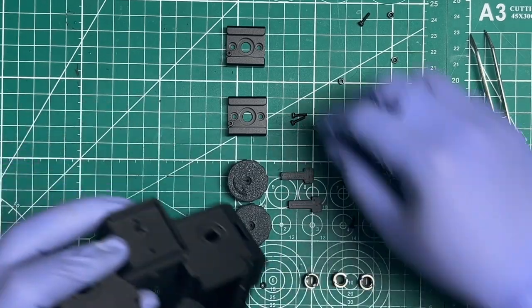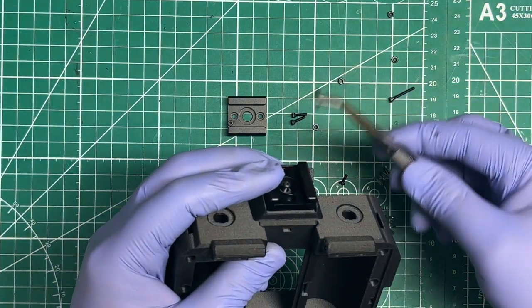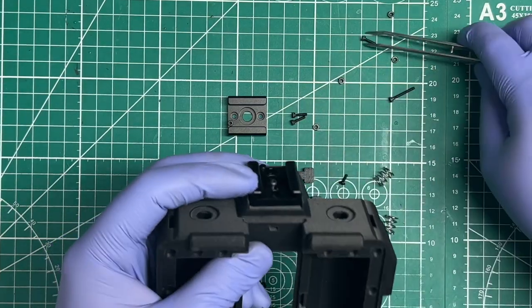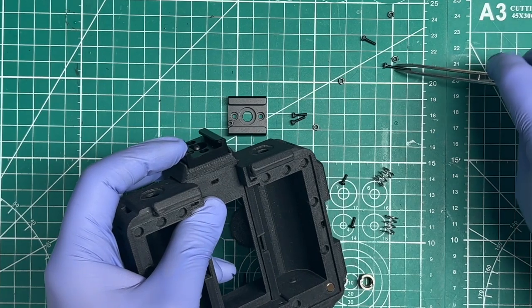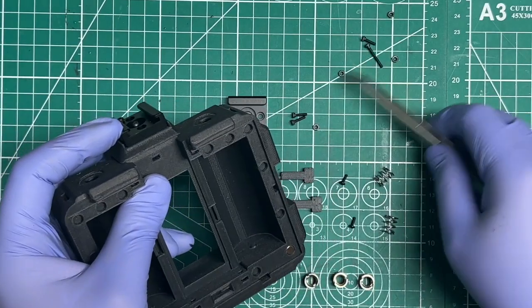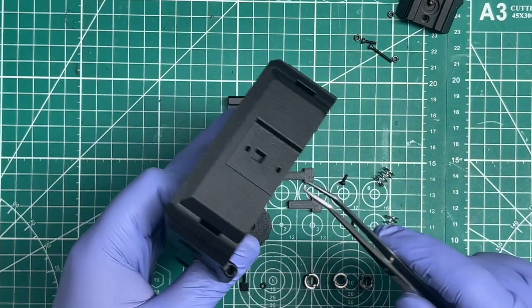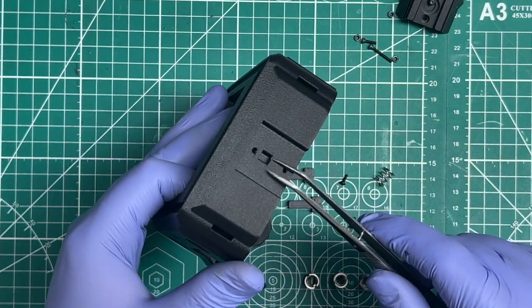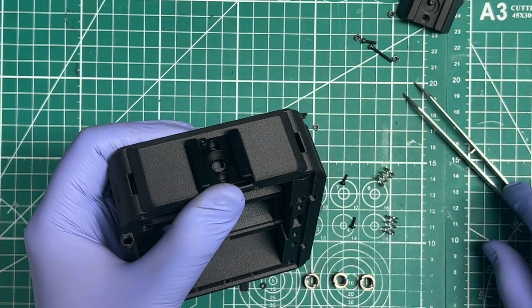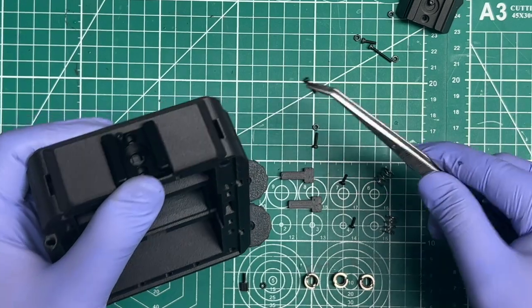But once that's all the way down, then you'd pop your cold shoe in there, and then you'd use the M2x8 one at the one over here on this side, because it only has a short way to go, and then since this one has a longer way to go, that's where you need that M2x16 there. All right, so that's pretty much that top part, or the riser part there. This side here, you're going to do almost the same thing. Put your nut in there, put your nut through there, and then attach your cold shoe. And that also uses 2 M2x8 screws.